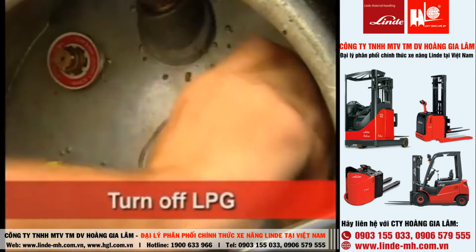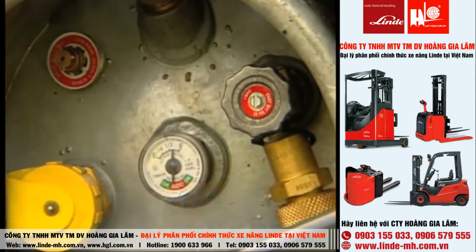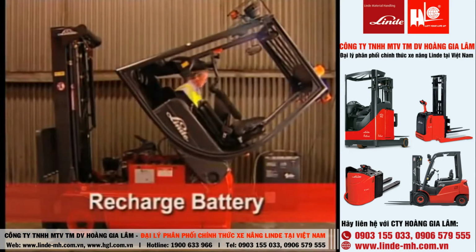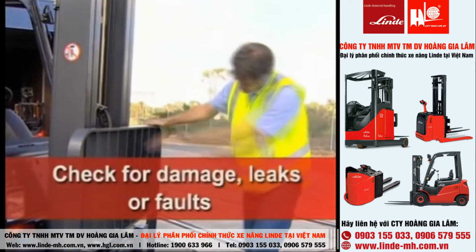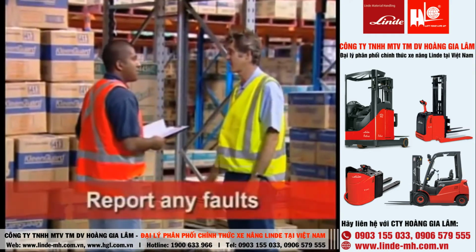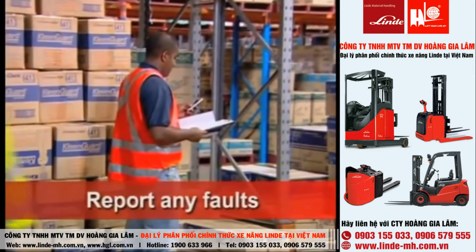If you're using LPG, turn it off to avoid leaks. If you're using an electric forklift, when parking at the end of your shift, connect the battery to a charger if required. Complete post-operational checks to detect any damage, leaks or faults. Report any faults immediately to your supervisor so they can be repaired.